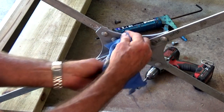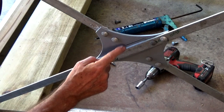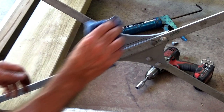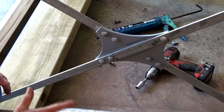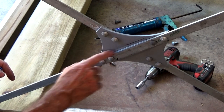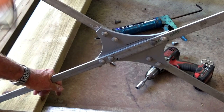This is the bit that I don't like doing — this is what's worrying me. That zinc primer is not adhering very well to this black steel. I think it's the oxide coating that's causing the problem. I've got to make a decision yet about whether I brush paint over that again to try and bond it really tightly, or I've got a two-pack etch primer which I might be able to put over the top of that. Either way, it's not very encouraging when you see paint that just doesn't stick — I put that on yesterday and it should have dried by now.